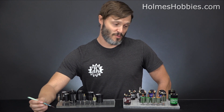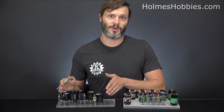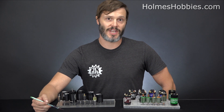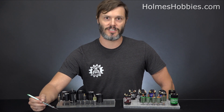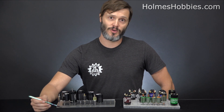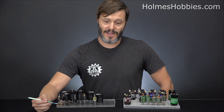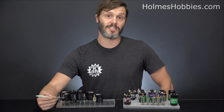If you're really not into that sort of maintenance, then brushless motors are going to be your next bet. The best thing about brushless motors is that they have essentially an infinite life. As long as you don't overheat them, get them rusty, or otherwise mistreat them, your bearings are really about the only wear point on the motor. The overall life value is far greater when you only have bearings to wear out.